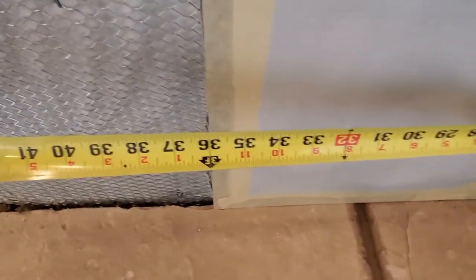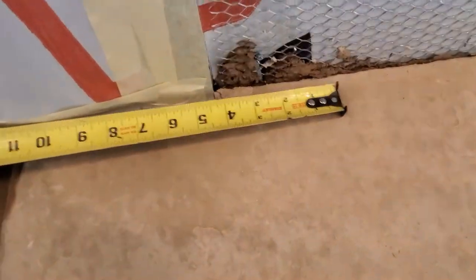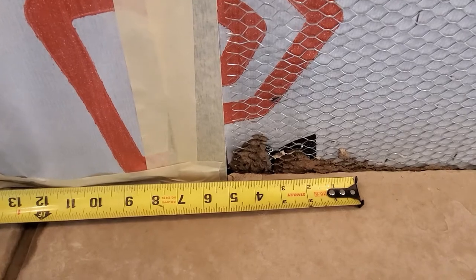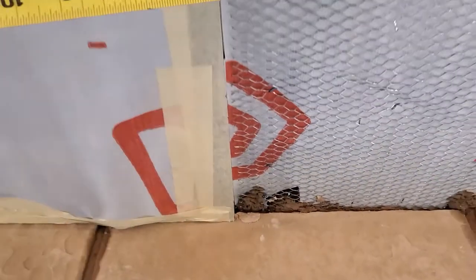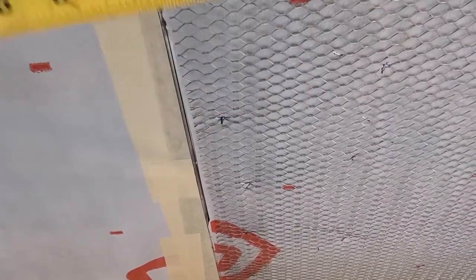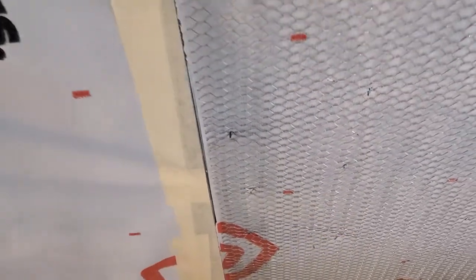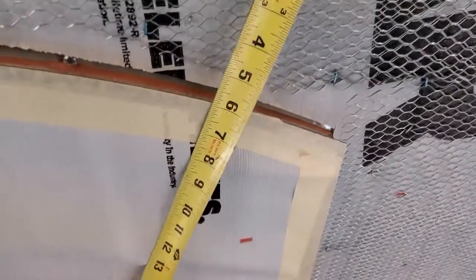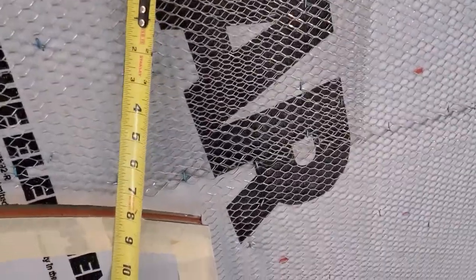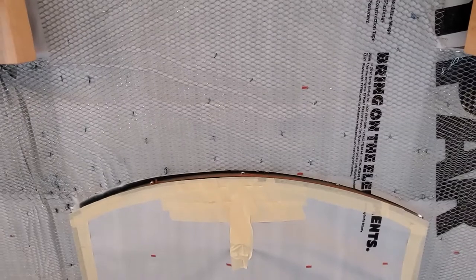This fireplace is approximately 3 feet wide. So we're gonna put a border around the fireplace itself. We're gonna cut some stones that are 5 inches wide. It looks pretty good to do a 5-inch. If you go too big, it looks off. It doesn't look right to do a border around this. So 5 inches works about right, and then we'll go 8 inches on the top. So we'll have a border that looks like this. It'll come across like that, kind of arch. And then we'll do a keystone in the middle.